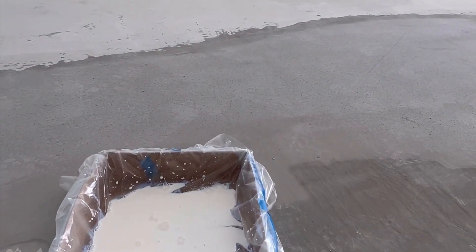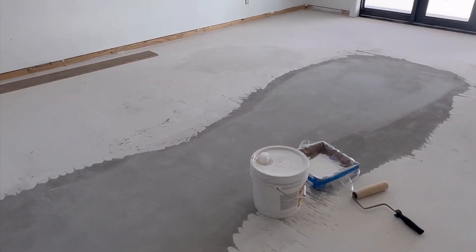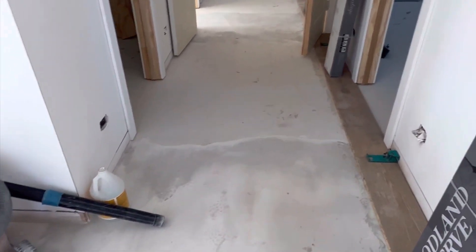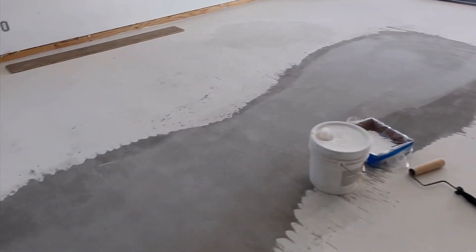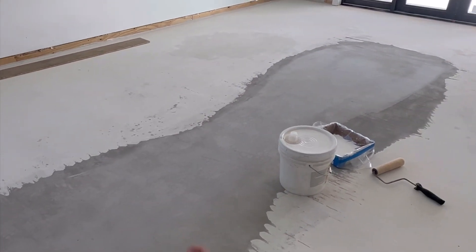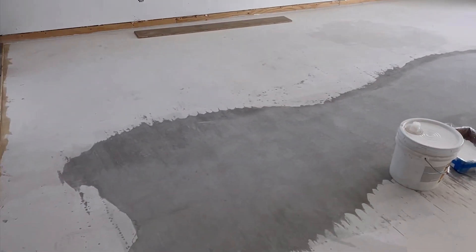This product goes for a place where it has moisture. We did a patch here, and it hasn't fully dried yet. We need to be installing the floors, but this area did not dry as fast. We need it ready for tomorrow, so we're going to be applying the moisture reducer here so we can safely install the hardwood floors.